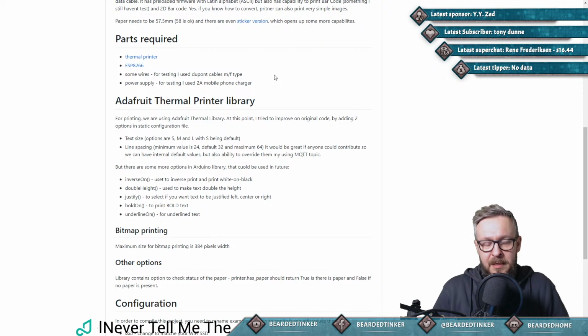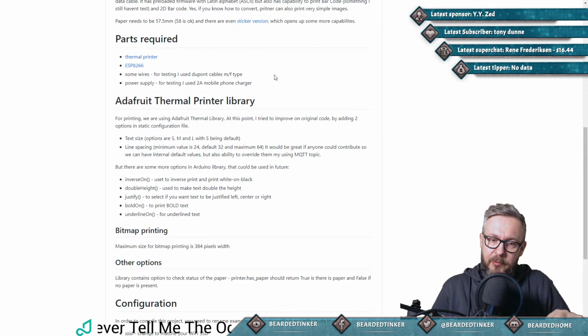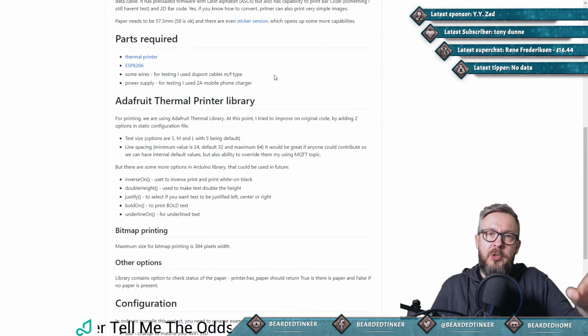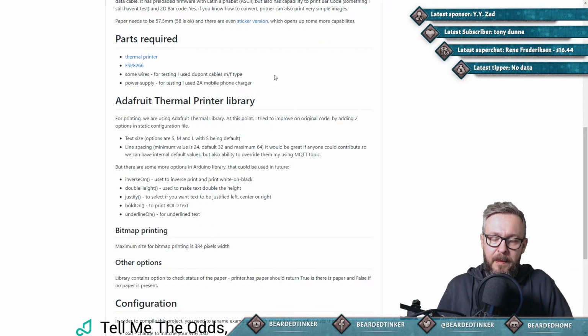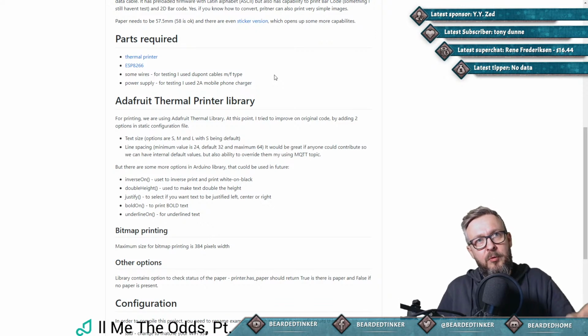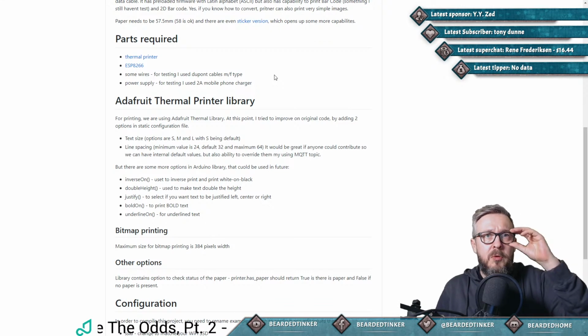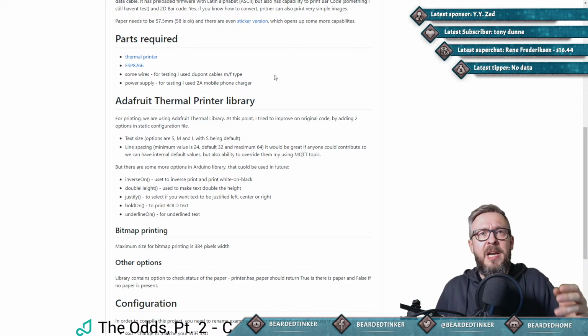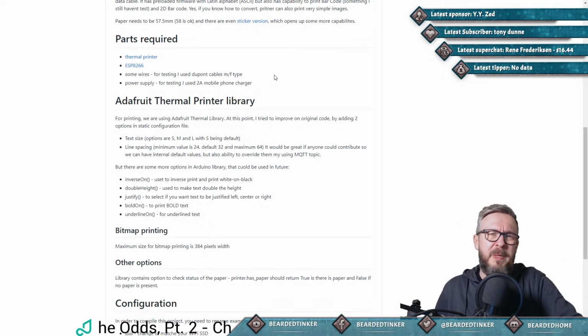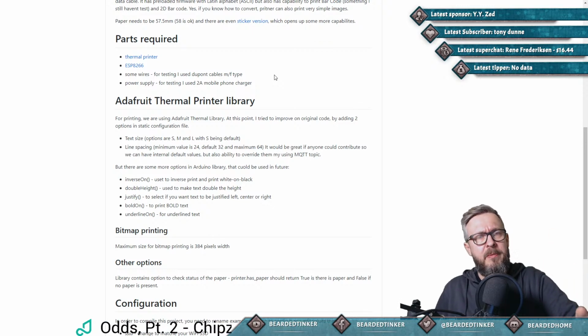He has great videos. So I have 2 types of charge controllers, 2 types of boards, and I wanted to test each type of charge controller with each type of board. And the idea is that if you are having ESP8266 or ESP32 projects, you would be able to make them self-sustained, meaning that you would not need external power. So for example, for the NFC tag reader, for this printer, no, because it's simply pulling too much power. It needs to have a stable 2 amp power supply.